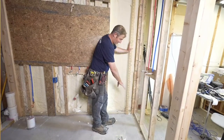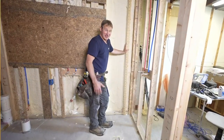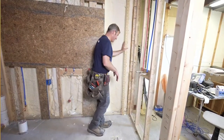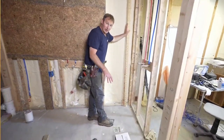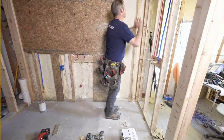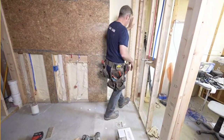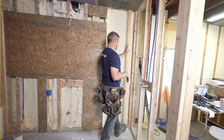So this is the cement floor. We're going to have a little bit of waterproofing, which is a liquid membrane, that's really not going to take up much more than a 16th of space. And we're actually going to be doing the floor tile afterwards. So this is pretty much an accurate measurement from the floor to ceiling, because the cement board, we're going to be also tiling the ceiling as well.